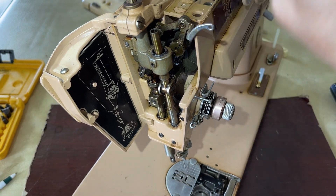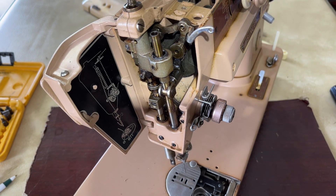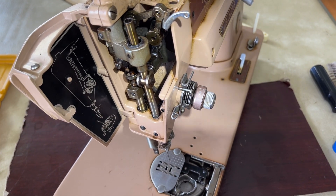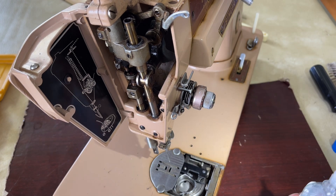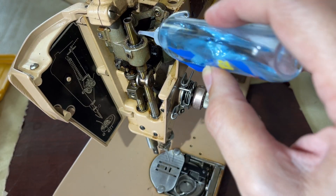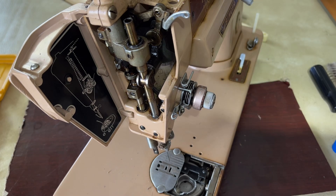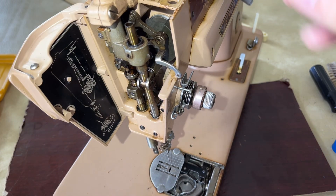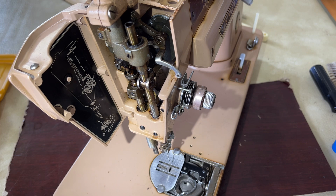Some of you the first time you ever see that honey-brown oxidized oil may think 'oh no, there's rust.' Rust doesn't come off nearly as easily as old oil — alcohol will quickly tell you if you have rust. Thankfully I have run into rust before but it's not as common as you'd think, mostly because if machines were stored indoors and not in a damp basement it's usually not prevalent. You'll sometimes get some rust on nickel-plated or chrome-plated pieces, but usually if you have rust in a sewing machine it's either really bad or not. Old oil is much preferable — you can get it off a lot more easily than rust.